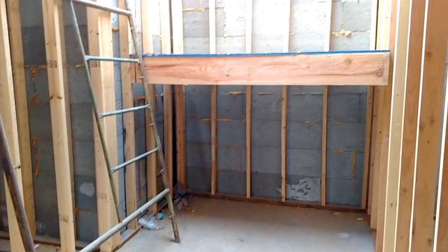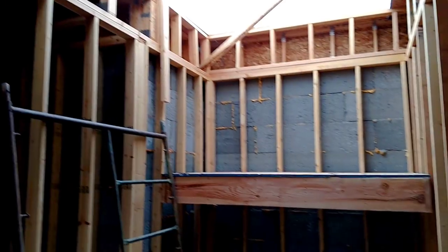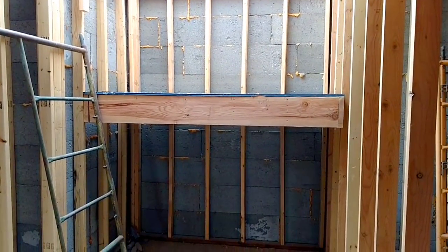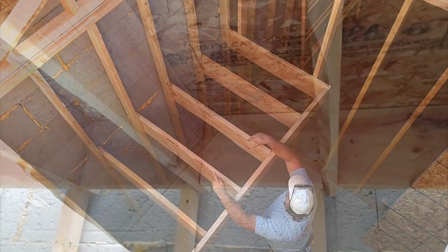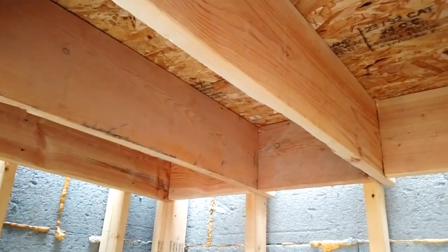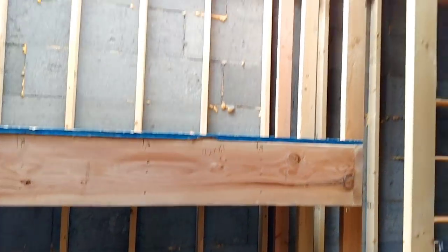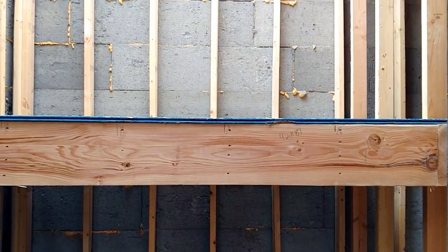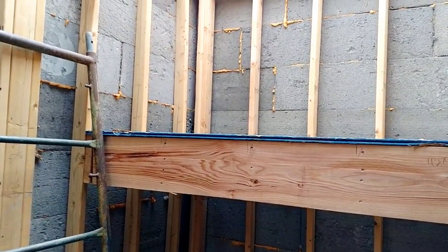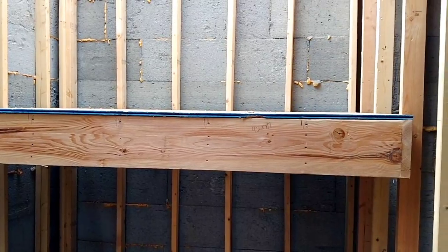We're building two types of steps right now. The first one goes up half a flight, hits a landing, then goes up the rest of the way to the top floor. The second one is a straight run. We're going to film both and explain how they work. We made this all out of 2x10s — probably a little beefier than it needs to be, but better safe than sorry. Math-wise, we took exactly half the distance from the finished floor upstairs to the concrete downstairs, and that's where we put the platform. Sometimes it doesn't work out evenly and you need an extra step up or down, but in this case it worked out right at half the distance.